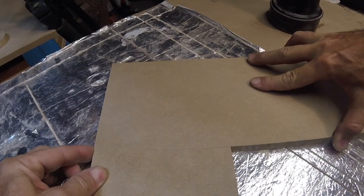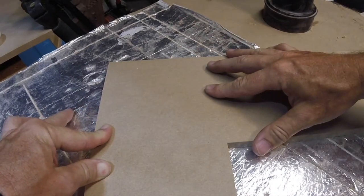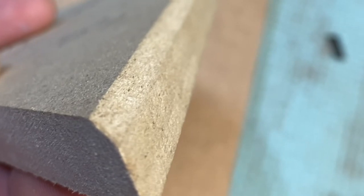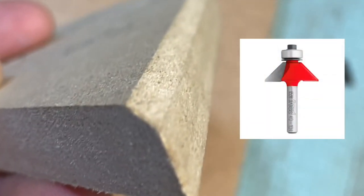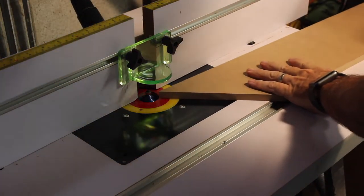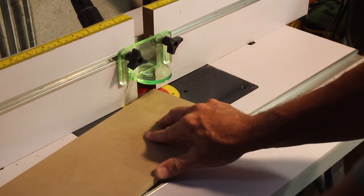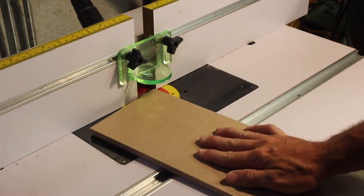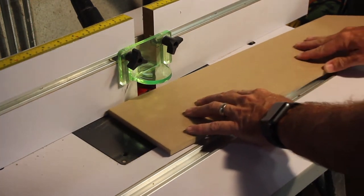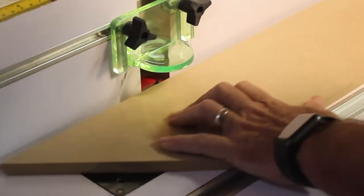Checking for square — that's a nice tight seam. You can see how important it is to put an edge profile; when those come together you can't see it at all. What I settled on after testing out a few samples was this chamfer — just a simple 45 degree cut coming down about an eighth of an inch — and I put that profile around three of the sides. The one with the 45 doesn't matter because it's going to be covered up, since we're putting a picture frame around the entire thing.